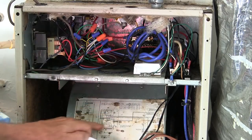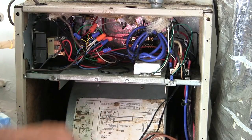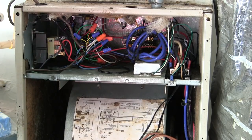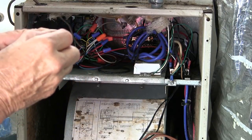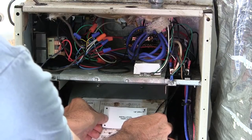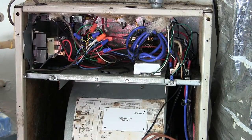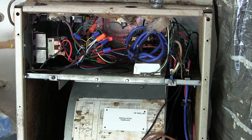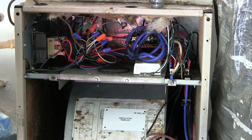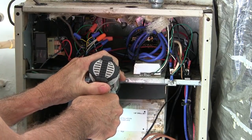The first thing I'll do is mount the template. I'm going to lose the wiring diagram that's on the blower housing, but to me that's not a big deal — that's pretty basic anyway. Let me get the backing off this template. I'll stick this template right here, and then I can take a drill motor with a 1/8-inch drill bit and drill some holes where they're marked.